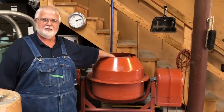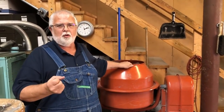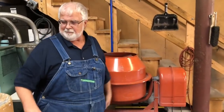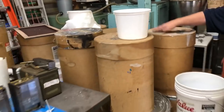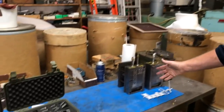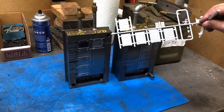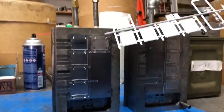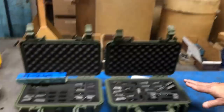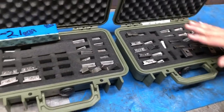Everyone needs a cement mixer. We get the pellets in a neutral color and we mix a handful of concentrate in and this mixes it. These are all barrels of reground plastic so that we can recycle as much as possible. And here's a whole different kind of molds — here's boxcar doors. These are molds to make the inserts for the trucks so we can make all the different kinds of trucks.